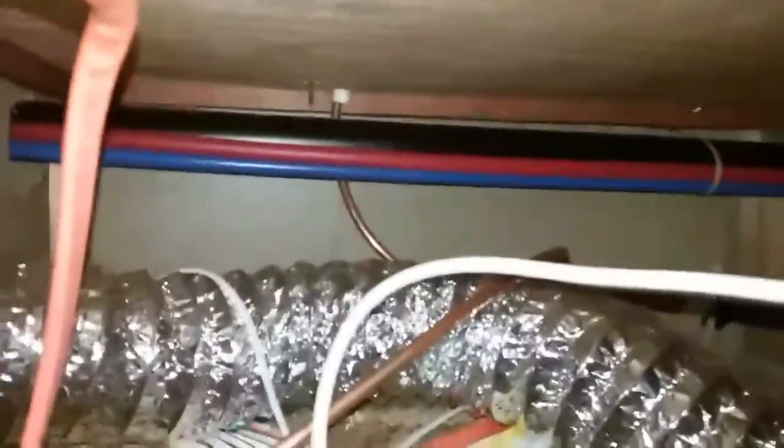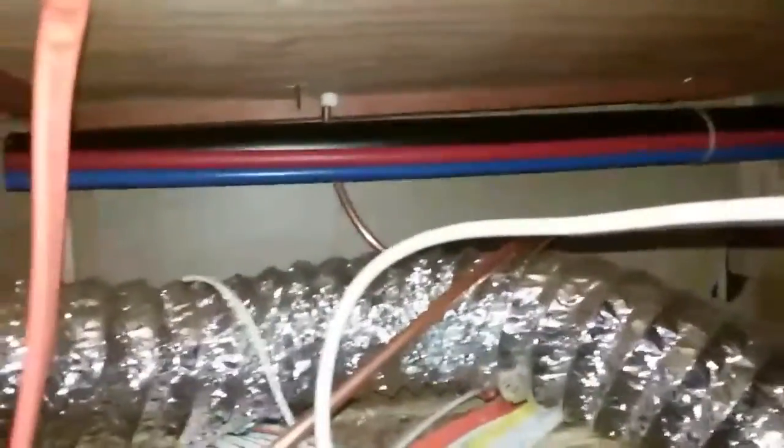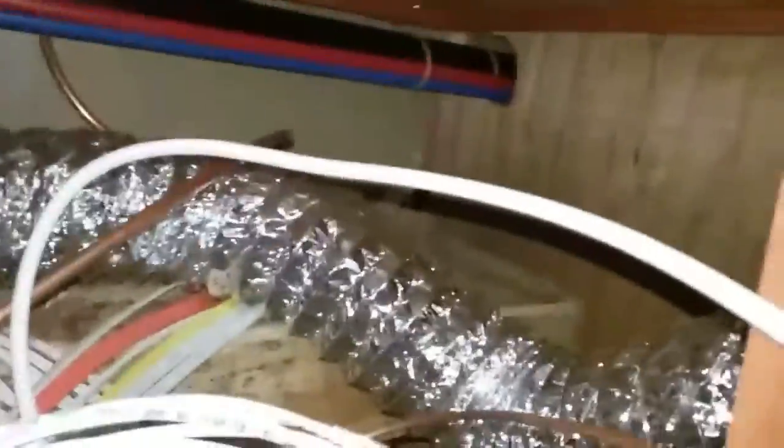Okay, so I have located my cables in the back. Of course, this is the front side where the converter and the fuses are. What I'm going to do right now that I have the cables in the back is run the cables right next to that copper line. That's for the propane tank. On the outside, I'm just gonna drill a hole, run my cables down, and hook it up to the solar charge controller. And I think that I'm gonna hook it up right in that wall that is gonna be inside the pantry in there.